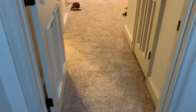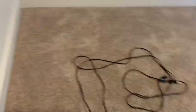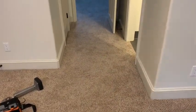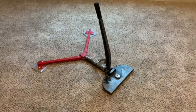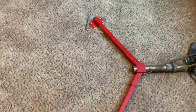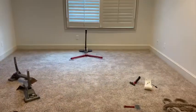I made it work without cutting into the hallway — you can defy reason. There's no reason to believe that this carpet could be stretched right there without opening the hallway up, because there were two walls indicating it probably wouldn't work, but it did anyway — and I did it with no poles. So there you go, for the crowd that thinks stretchers don't reach beyond the back feet: if the back feet are here and I stretch it all the way to the door, you can clearly tell that it does stretch beyond the back feet.